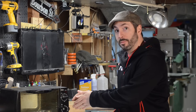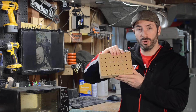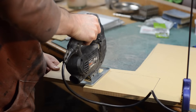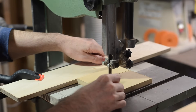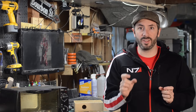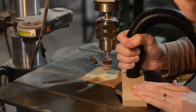The next thing we need is our vacuum form table. This is just a wooden box with holes in it. I made my holes out of pegboard because I had some lying around — I just traced it out using my frame, since the frame is going to go all the way over it. I cut out my wood pieces using my bandsaw, whatever saw you've got will work just fine. When you cut out the side pieces, you want to drill a hole in one of those sides for the vacuum hose. I used a Forstner bit on my drill press to drill out the hole — it was just a little bit small, which is good.